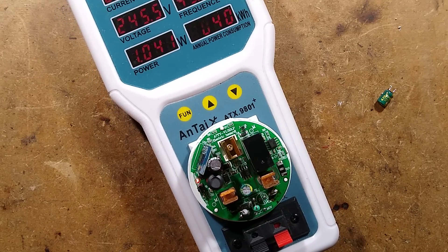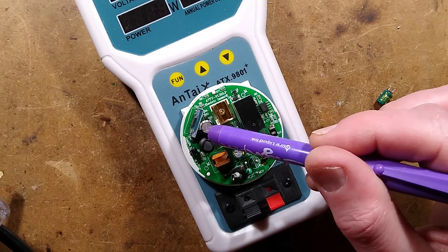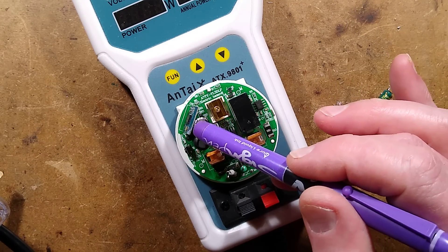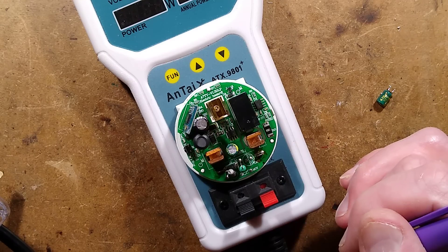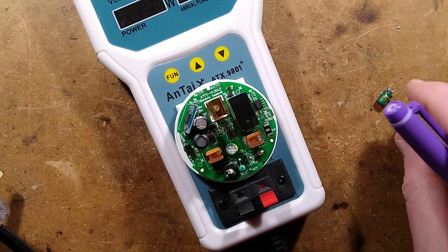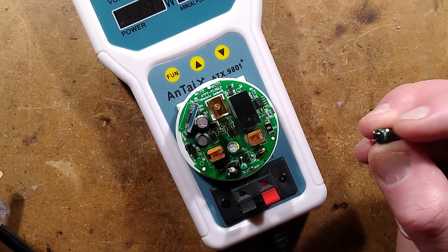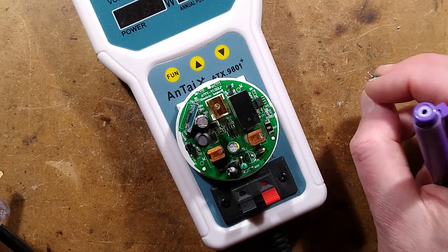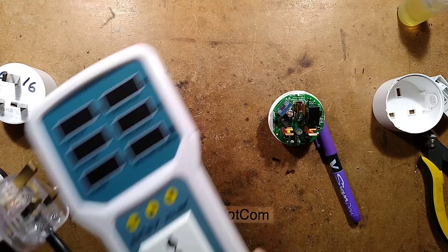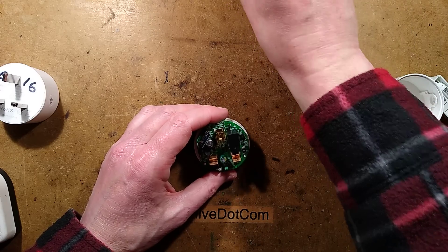So that was the problem. It was the classic situation: these capacitors are dealing with very high frequency and they tend to fail quite quickly — it's just a weakness. They could have used a polymer capacitor, the solid electrolyte type, but they didn't, and that kind of kills the whole product. So Gordon, there's your answer — this one is slightly domed at the end, and that is the thing that failed and took out the whole unit.